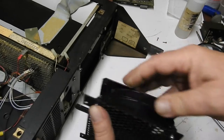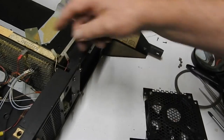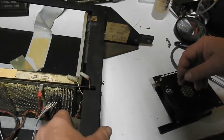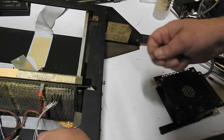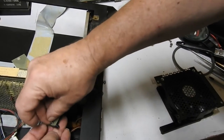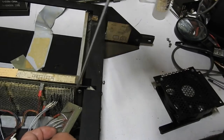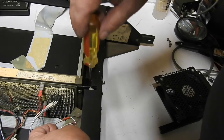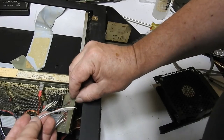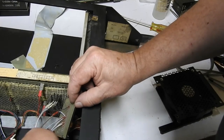I'll keep those as spares and put a couple of M3s there. So that's how you get the fan out. The serial cable going to the Berg connector down there is held down with some double-sided tape, and the PCB for the Berg connector is held down by two small screws. You need a thin-bladed slotted screwdriver, a long one, because you have to come in from here and from here. Looks like I managed to break off three wires, so there's a bit of work trying to understand where they came from. Either hot glue them or cable tie them together so they don't come off again.